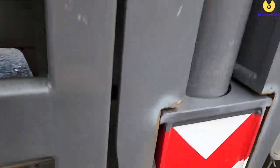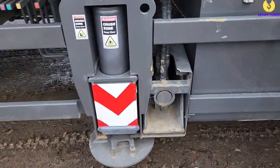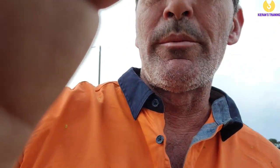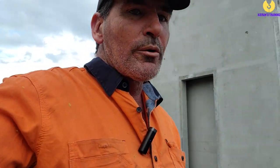While I'm on this side, I need to keep in mind that this is the high side. It's a good idea, when jacking it up, to finish on the high side — that way, if your wheels are clear of the ground on the high side, they're going to be clear on the other side as well. So I'll work my way back around to the low side and start there.